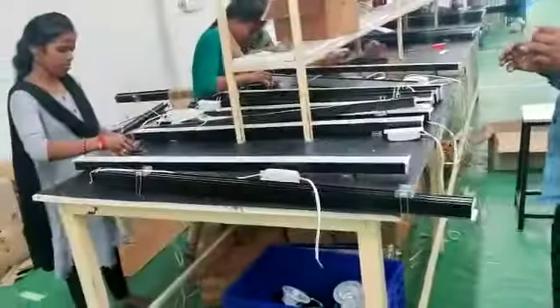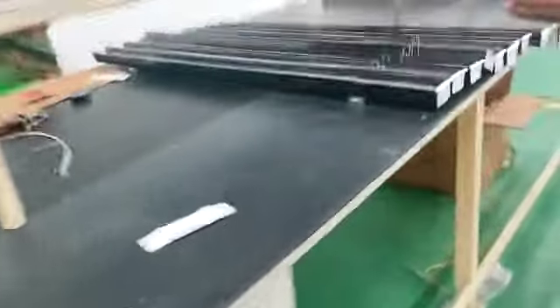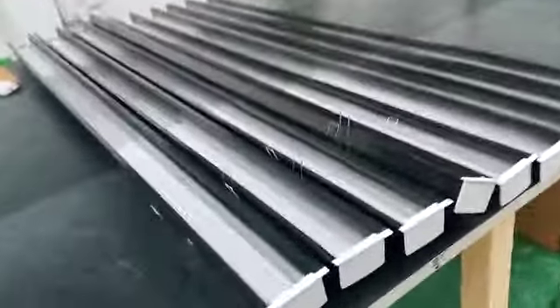So you can see the illumination of the light — the illumination will be very high. It is like a 40-watt, more than a 40-watt clip light. We are using a 3-strip setup here. Each strip has 20 watts, so 3 strips is almost 60 watts total, but we are using it for only 40 watts. This profile light is best suitable for linear lighting.